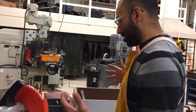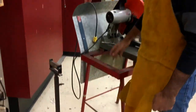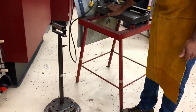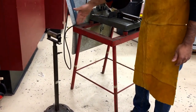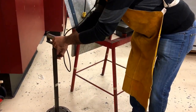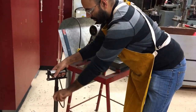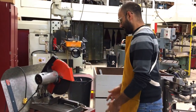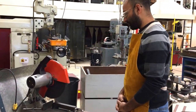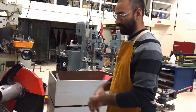You also want to make sure the support stand is readily available if you're cutting long material. Set it up so it's at the same height as the table — you can rest your stock across and lean it on the stand. It's easily adjustable for a variety of heights. Set that up before beginning your cut so that everything is sitting nice and flat. That's pretty much it for checking the machine to make sure it looks good and safe to use.